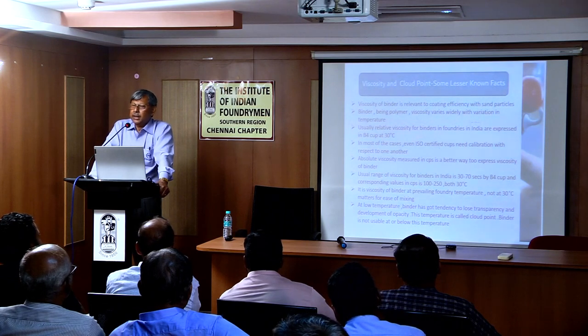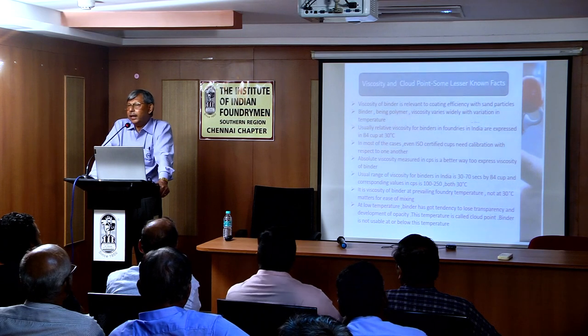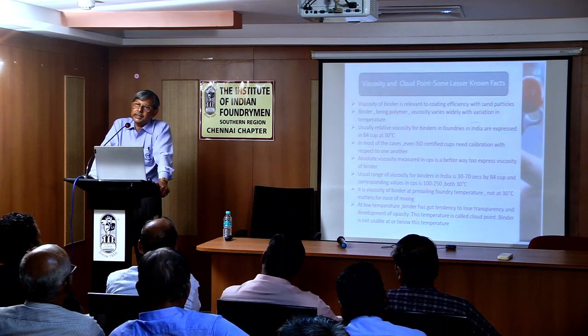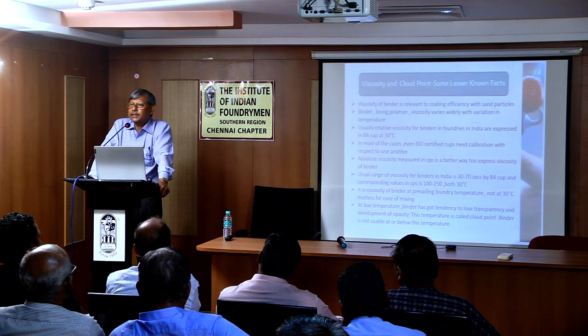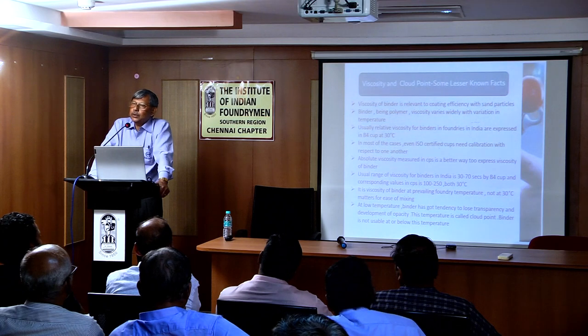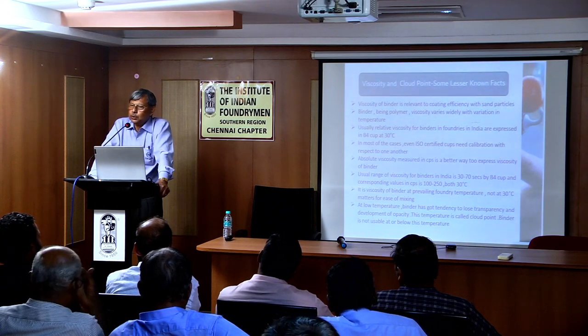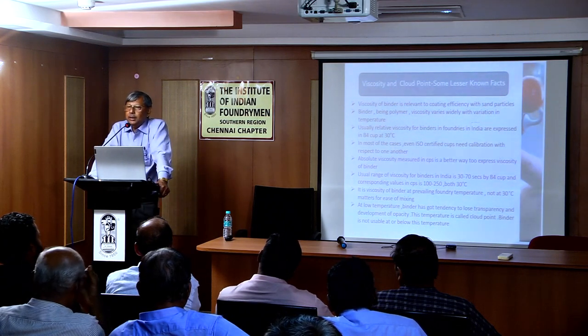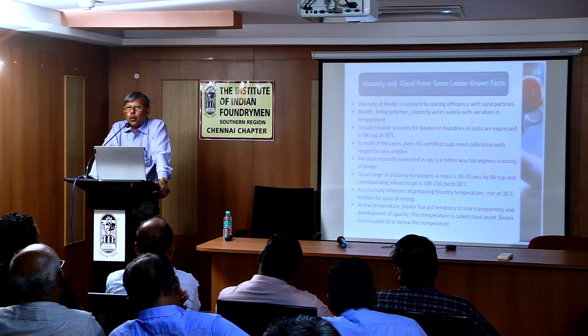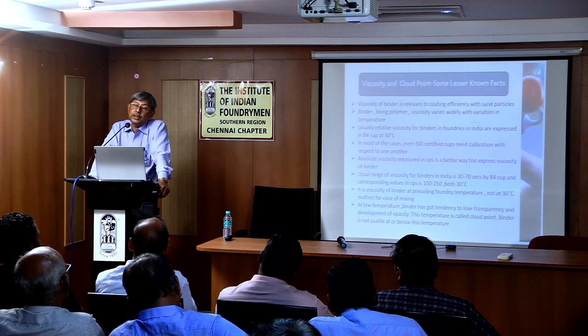It being a polymer, the viscosity changes. Any liquid's viscosity increases with decrease in temperature, and for gas it is just otherwise. So for all liquids, but especially polymeric liquids, there is a drastic change in viscosity depending on temperature. And the lower the temperature, the more the viscosity. So why do you want to define the viscosity, and at what temperature?